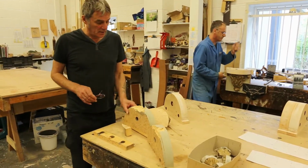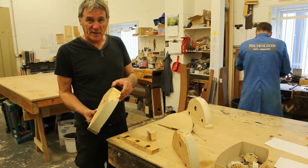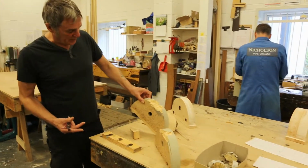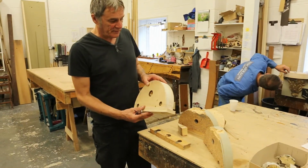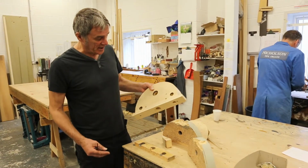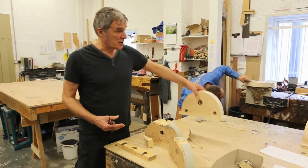These are the front pipe cantilevers, which when they were dismantled, almost fell apart in the organ builder's hands. The woodworm was so deep into it. So we've had to replace them, and these are the new ones, made of an old pine to hopefully keep the integrity. Also, they would never have been wind-tight. They would have been leaking like a sieve. So we've done four of those.